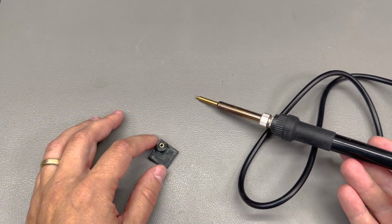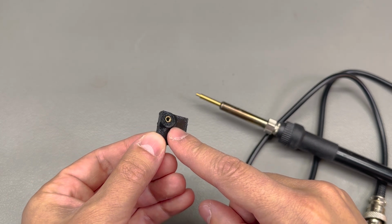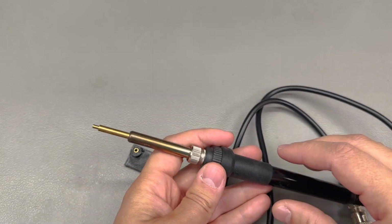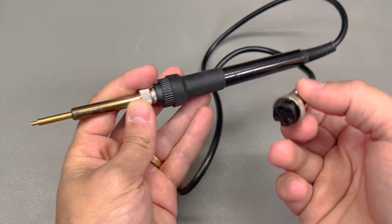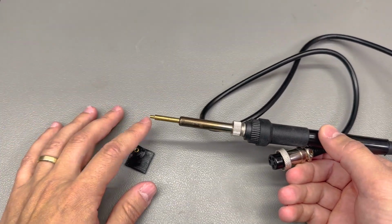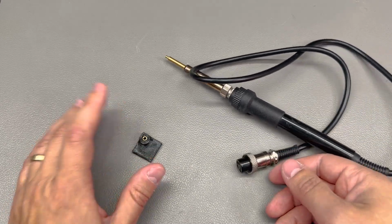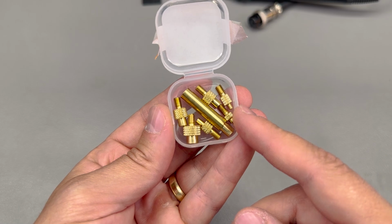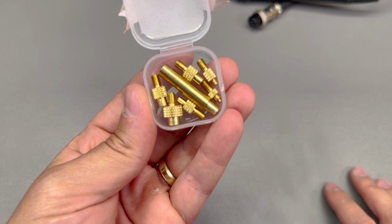And so a few weeks back, I needed to place some of these threaded inserts into a 3D print. And since I don't have any more of those old style Hakko, I believe it was 936 soldering station, I couldn't use this attachment anymore because I'm just using JBC and JBC clones these days. So I went on AliExpress, and interestingly enough, there are plenty of off-the-shelf options right now, like this kit, which comes with various size tool heads for dealing with various size threaded inserts.